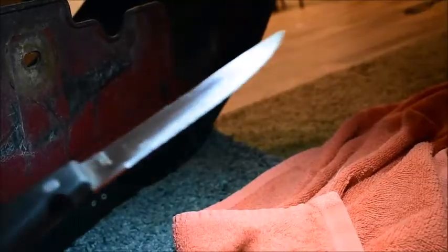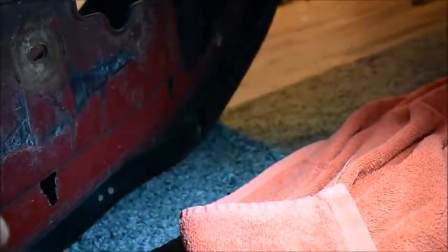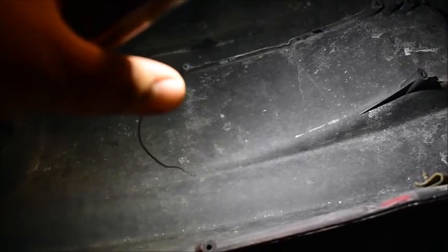I'm gonna cut out around here — you can see I made a mark, it's not perfectly straight. You go around there and then down through here, but make sure you don't cut these tabs because that's where the screws go, so go around them. Then just cut up around these and basically cut the whole piece out. I'm cutting it with a knife and heating it up so it slices through nicely. This material is a bit harder, so I'd actually recommend using a saw of some sort.